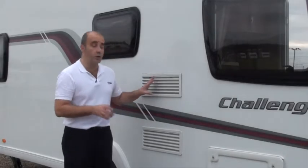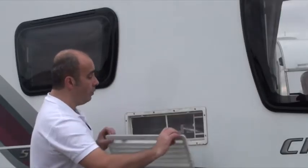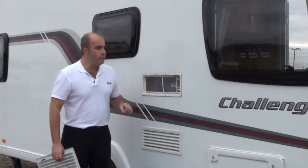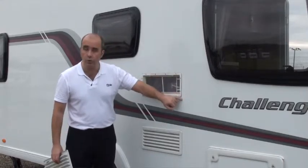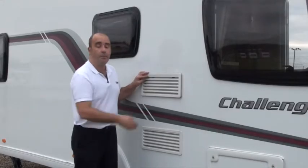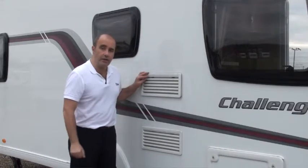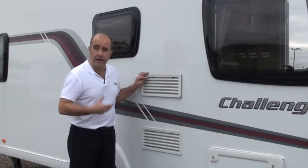As part of your process, make sure all grills inside and out are kept clean. Remove the grill and give the mesh a good wipe down and vacuum to clear cobwebs and anything blocking the area. Another issue is dampness — the silicone around vents can perish, so check it and re-silicone if needed to stop dampness getting in. When the grill is back up, don't cover any of the grills around the property, as they allow air to circulate, sterilise and keep dampness down.